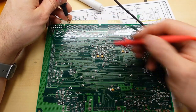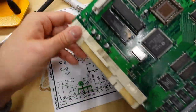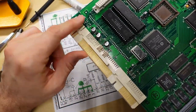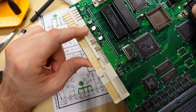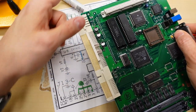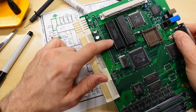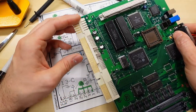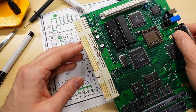But yeah, the fault somewhere lies in here, and I'm predicting it's up in that area, specifically because there are these capacitors here that leaked, and it must have leaked underneath the connector or somewhere and caused damage. Now, I did inspect under these capacitors when I had them off on the other board, when I recapped it, and there was no damage whatsoever that I could see. But there's vias underneath here and under here or wherever it is, and since I can't find it, there could be damage there that I can't see.